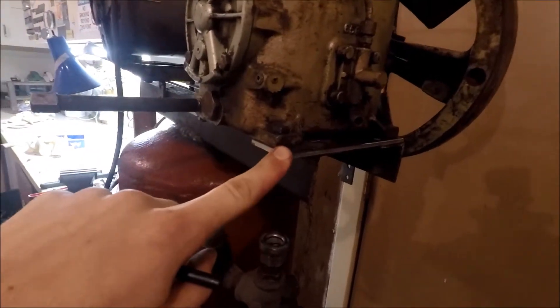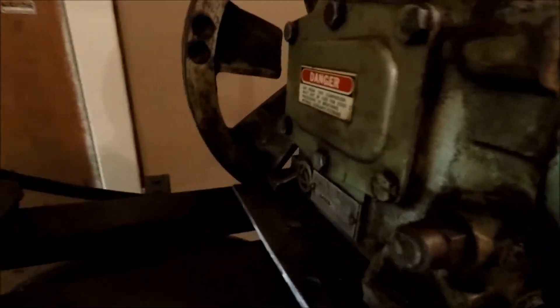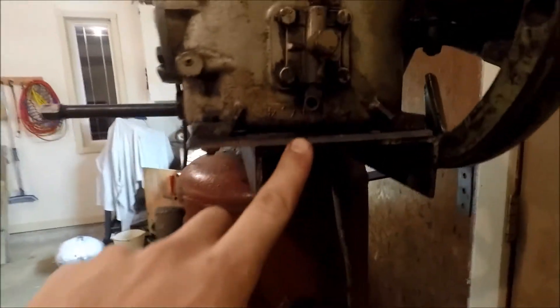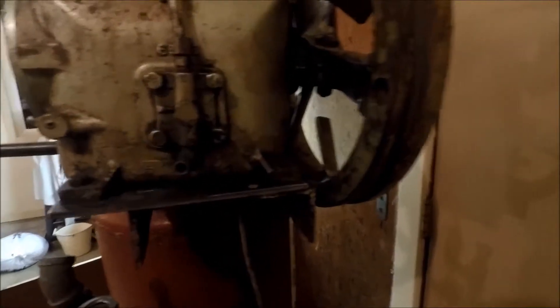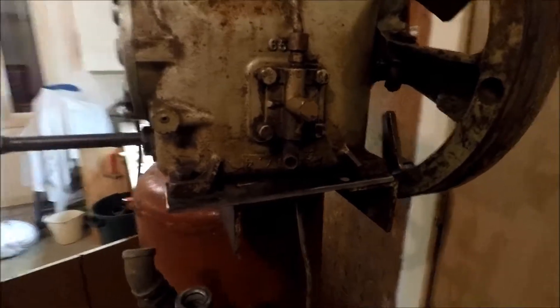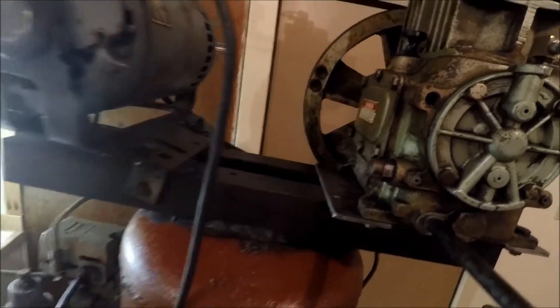What I've done here is I've just made some permanent brackets out of some scrap that I found. Now, because the angle iron is not wide enough for the bolt holes, I take a transfer punch, put that down there, punch it, and then use a hand drill to drill those out. Then when I get my welder out, I'll just weld these brackets on there solid. I've got the vice grips on there temporarily because it was leaning this way when I tighten the bolts.